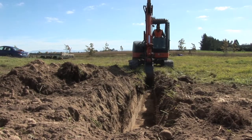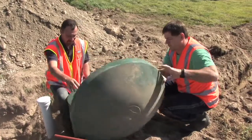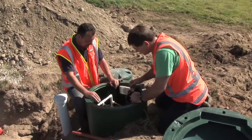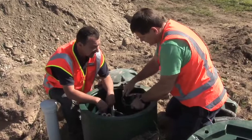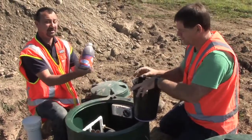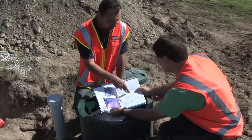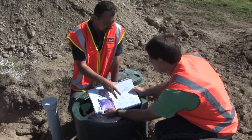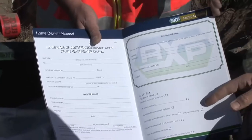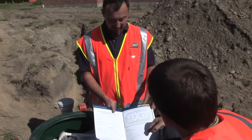While we are doing that, the operator will dig the lateral pipes out to the designed irrigation field. All components come in the blower box: valve boxes, fittings, and a bottle of biozyme. Biozyme is a kick-start agent which will help the tank start away. It comes with a homeowner's manual with wiring diagrams, completion certificates and warranty cards, to be filled out by yourself and the installer.